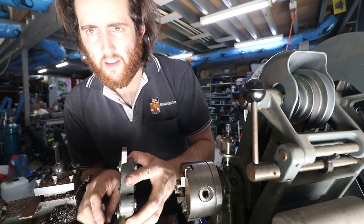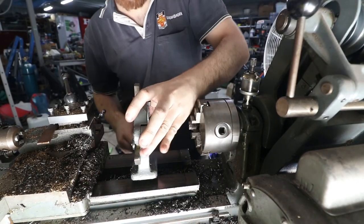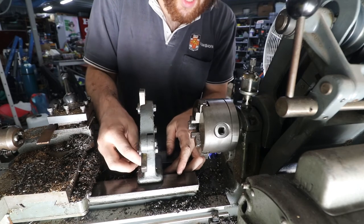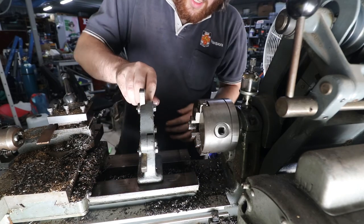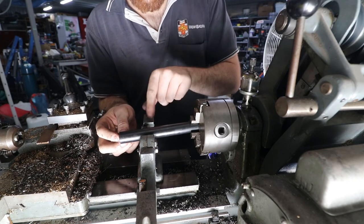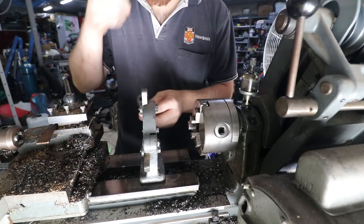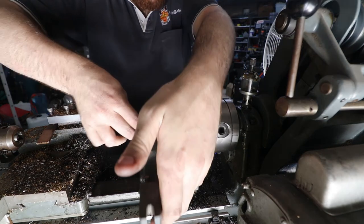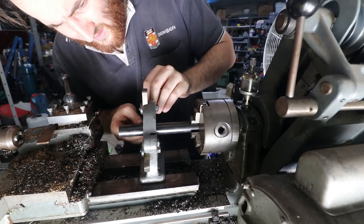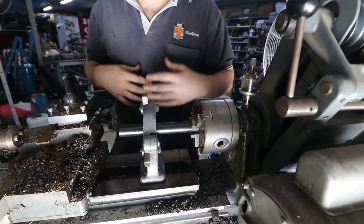This is the steady. I'll move you down a bit so you can see what I'm talking about. The steady has some little adjustable guides. I don't know how this is going to go on plastic, because normally you want the guides to be softer than the thing you're machining, but in this case the guides are brass. But what we can do now is flip this open, put our piece of plastic in here and then adjust the guides up to it, and it'll help hold it for us. As far as a bit of plastic goes, it's got a hole in one end already, and the hole's smaller than the one I have to drill, so I may as well use the end that's already got the hole put in it. There you go. So a piece of plastic is supported at the end now.